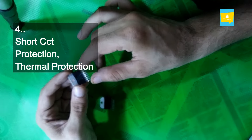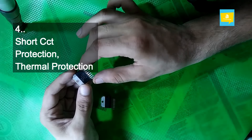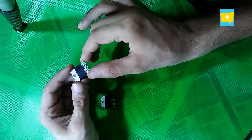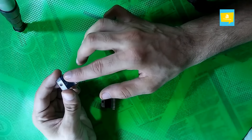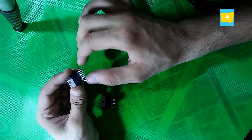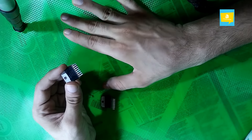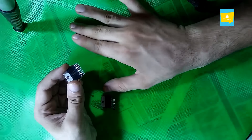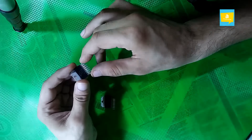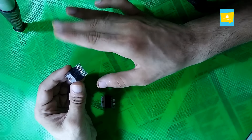Number 4: The best feature is that you get short circuit protection. If there is a short circuit in the output, the integrated circuit has short circuit protection installed. If there is a problem in the load, or a problem in your speaker, or a faulty connection, the IC will automatically shut off for a few seconds so that you know there is a problem in the output and you can rectify it. This is the best feature — you don't need any external circuit for this.